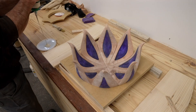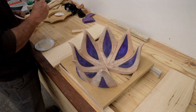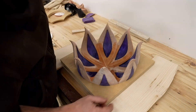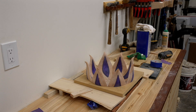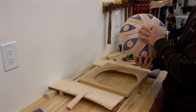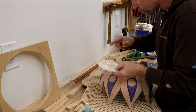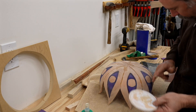For the glue-up process, I put all the petals in the jig, then removed them one at a time, applied some glue, and put them back. This way it kept the rough shape without falling apart, and I could just let it dry in the jig. After it dried, I popped it out. There was quite a bit of squeeze-out on the bottom. I wiped all the glue off the top, which was pretty nice. On the bottom, I had to do a lot of cleanup and fill in the gaps with a little bit of glue and sawdust to hide any imperfections.